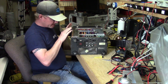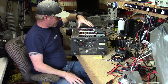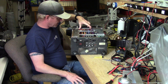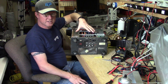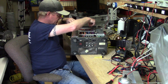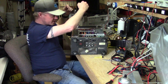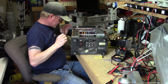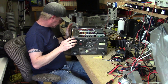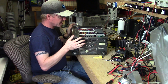I do know that this particular section will come out here — this is basically all of the RF section. All of the boards are here and they go onto a motherboard in the lower section of this unit. The front display board you can disconnect; it has card edge releases and you can lift it all the way out. Everything else looks fairly easy to get to, and I believe if I can actually get the power back up, this thing will kind of come to life.